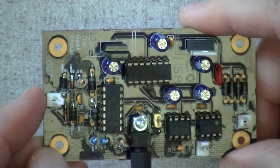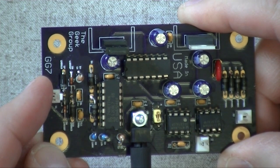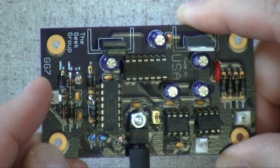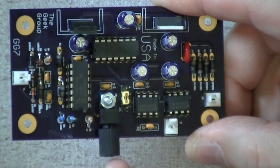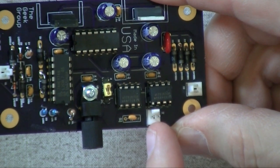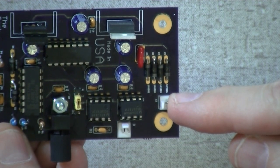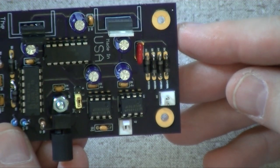That's your hardware side. So when we're done, we connect it into the rest. This connector here goes off to our detector, either an antenna or a current transformer on the secondary. This is our fiber optic input. This is the output to our gate driver, transformer, and bridge. And this is 12 volts AC coming in right there. It's beautiful. All right. So that is your hardware assembly on your GDT driver board.